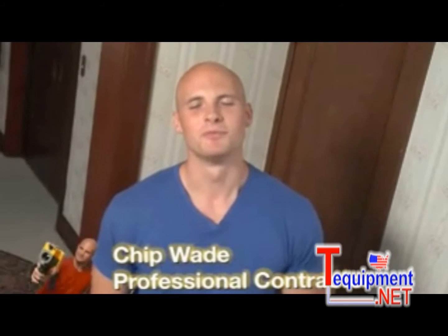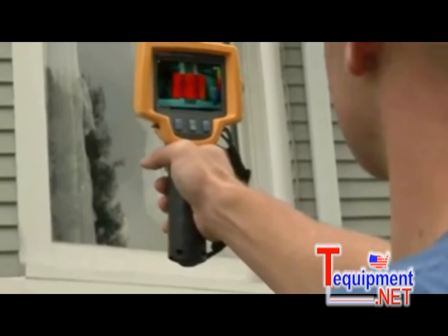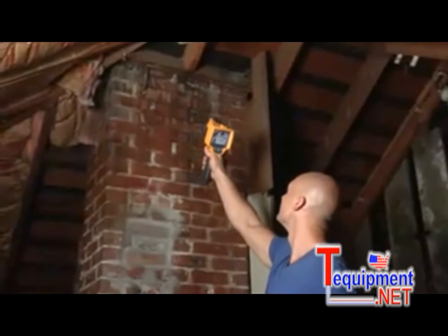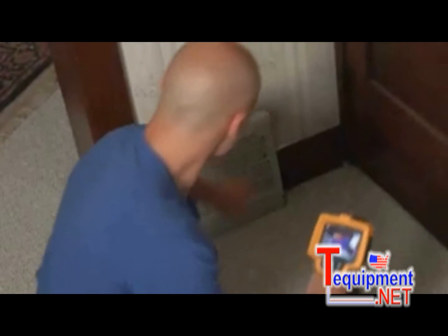When you're inspecting a home for sale or for renovation these days, you're going to run into the question of energy efficiency — it's on the mind of everybody who's paying an energy bill right now. The Fluke TI-R1 Thermal Imager is a great way to check for heat loss in ductwork, walls, and around vents. This 100-year-old house had quite a few areas that could use improvement. Ideally, when you close a vent, you want to eliminate all the hot air coming through it. Take a look at this closed vent through the Fluke TI-R1 — these old vents just don't seal very well, and you can see the energy loss.